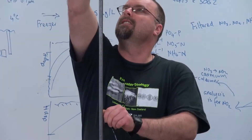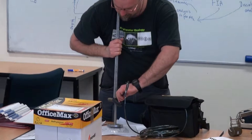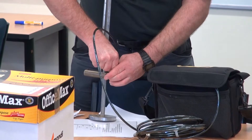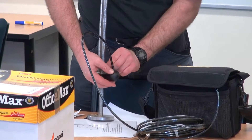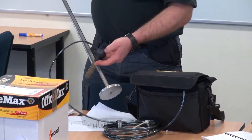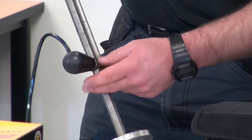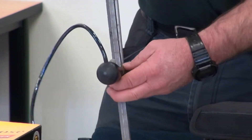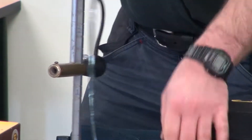The sensor here fits onto the rod and just screws up. Now this has got three little sensors on it that will detect your flow right through there and do all the calibrations. It's got an arrow on here that shows the direction of your flow. So always have that bulb going into the flow — don't put it the other way, you won't get a reading.